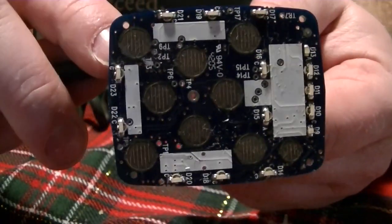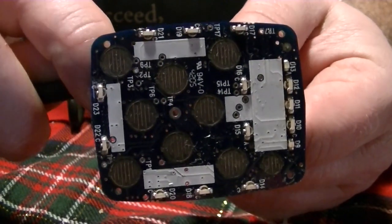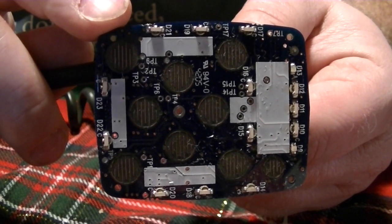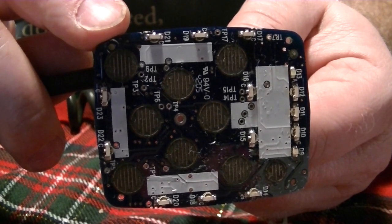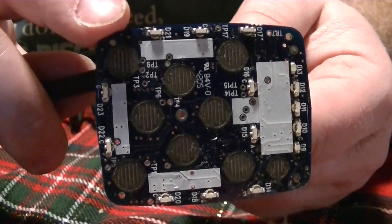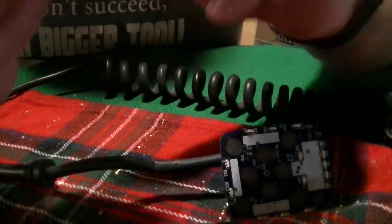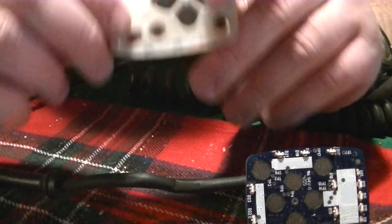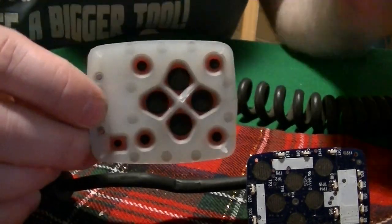Right, you can see those pads are much cleaner looking now. I think it might be gold or copper on there. It's just a real thin layer, just enough that electricity runs through it. But when you get a little bit of corrosion on it, it won't make that connection. So now I'm going to clean off these pads a little just to make sure there's nothing preventing these from making the connection. All right, pads are clean. Let's get this reassembled and back in the truck and see if it fixed it.